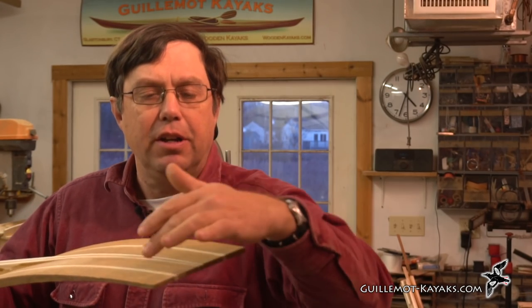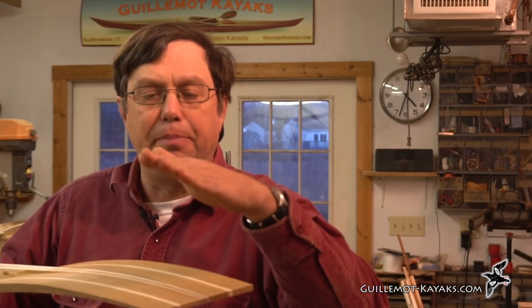So at the tip here, it's flat all the way across on the back face and the power face. And that's with 36 grit. I will replace the sanding paper on this with 80 grit to just give that a finer finish. And then final sanding with this will come much later after I've done a lot more shaping.